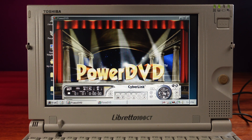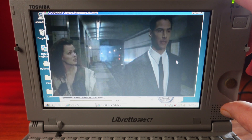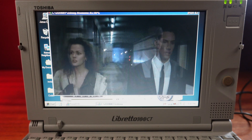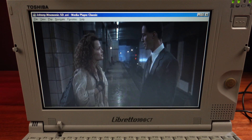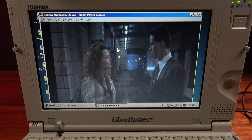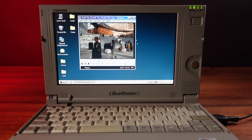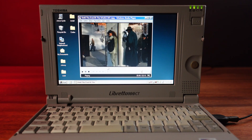For example, I want to try playing some DVD quality 480p video on this 800x480 LCD. I'm hardly getting any frames of video out of this, as the CPU is just unable to keep up with decoding the MPEG-2 video stream. I also tried playing some AVI encoded files using the XVID codec, but this requires even more CPU power, and at 480p resolution the player just seems to freeze up. This CPU is powerful enough to play MPEG-1 video though, at 240p resolution.